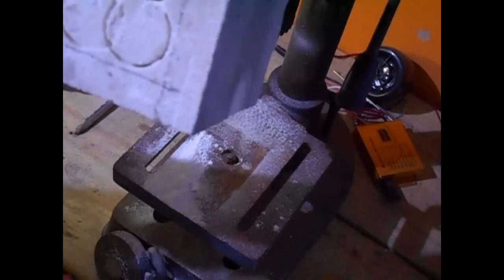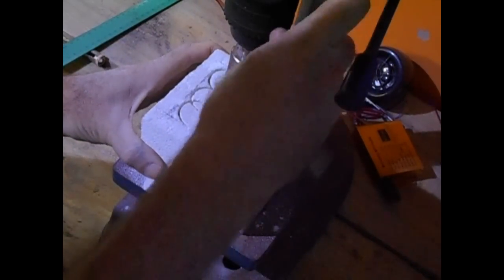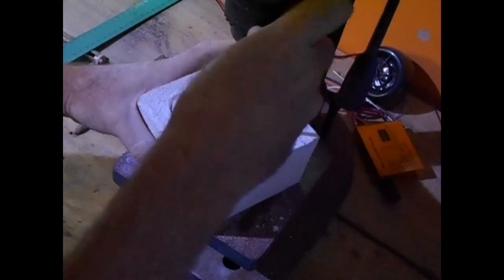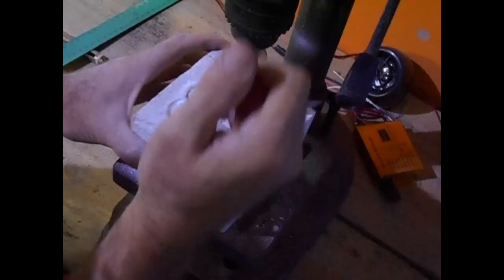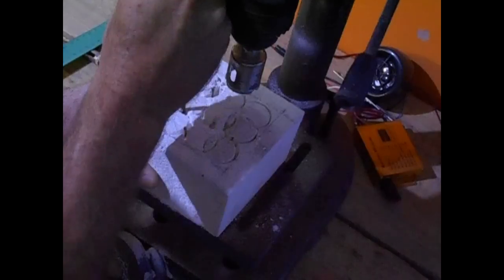So now we carry on, we break out these cores, and then we'll smoothen out the sides and perfect it. When you're doing this, you mustn't lever against the side, otherwise the side might break out. You use the other cores as a leverage. And you'll hear the snap as they break.